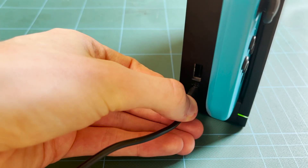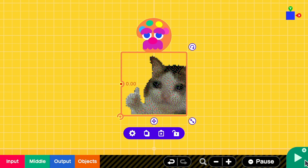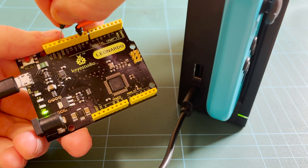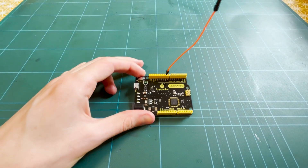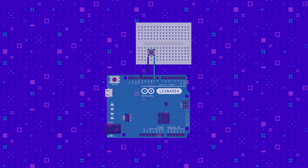Once the process is done, disconnect the Arduino from the Switch — and there you have it. Your texture will have been perfectly recreated in GBG. One really important note: make sure the jumper wire is disconnected from ground any time you finish running the sketch and before you connect it to your PC, to make sure you don't run the sketch when you don't mean to. If you're using the button setup, you don't need to worry about this.